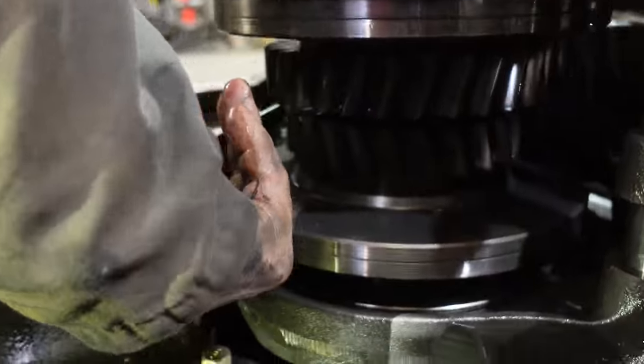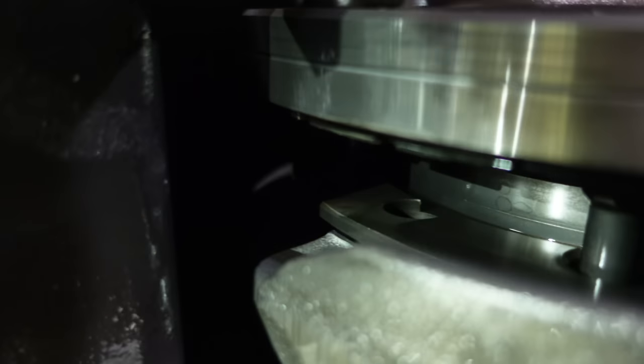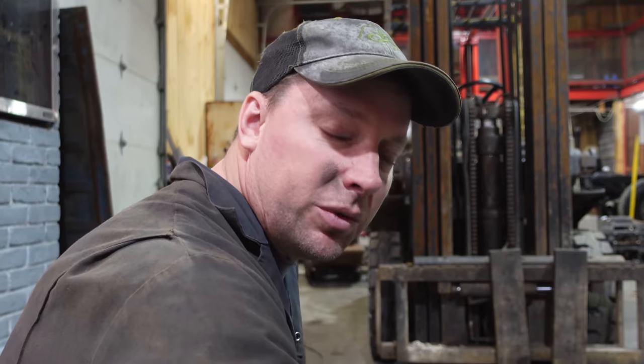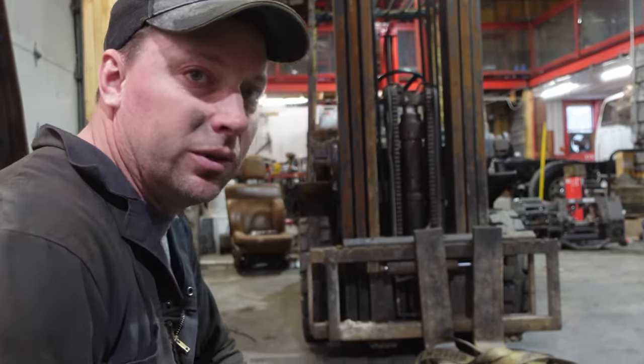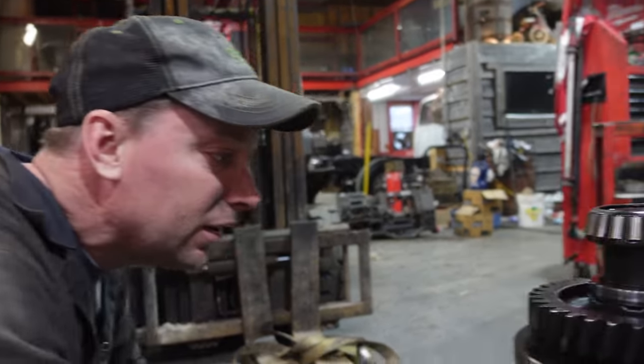is missing. And they're all missing all the way around. So that pin likely broke in half at that. See the hole with nothing in there? There we go. I wonder if that synchro is not sitting 100% square in there and then that's dragging instead of that clutch. Yeah. And that's always dragging, and that's why the rest of it doesn't shift. And those clutches are black, right? Yep.